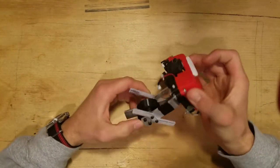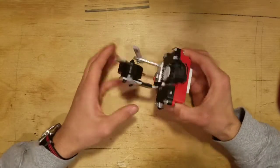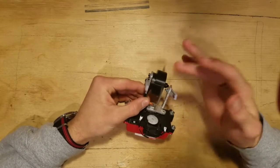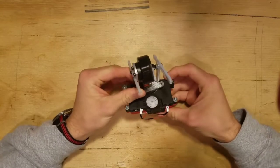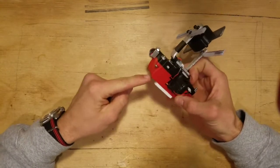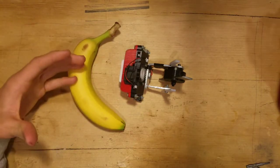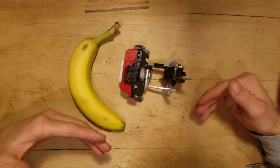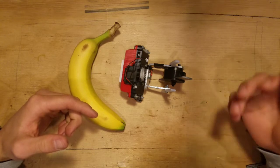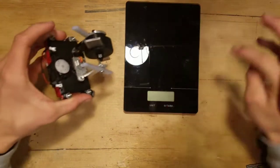This is the robot and as you can see it's pretty much done — it's in functional condition. I still have to paint it and do a few more finishing touches. Up here is the weapon bar, the servo which operates via a gear system, and the weapon arm which is separately mounted from the servo. There's a three-piece body construction. Here's a banana for scale — it's still pretty small. This is a fairy weight, which is standard 150 grams, however these robots usually receive at least a 50 percent weight bonus.